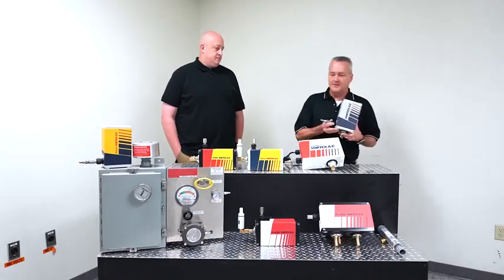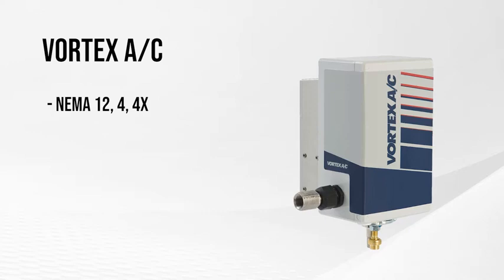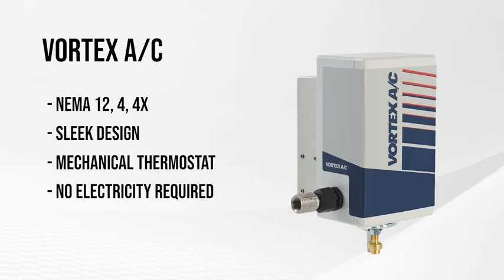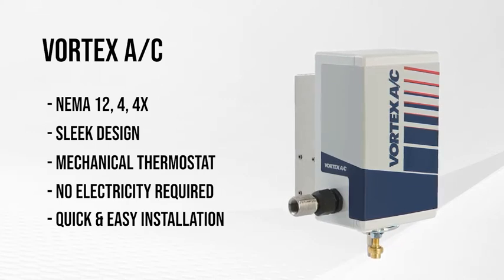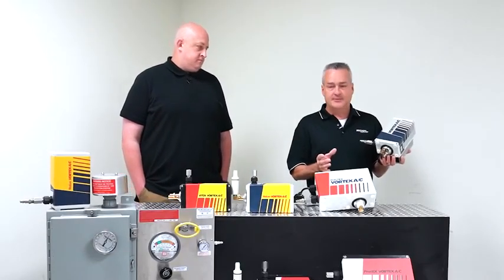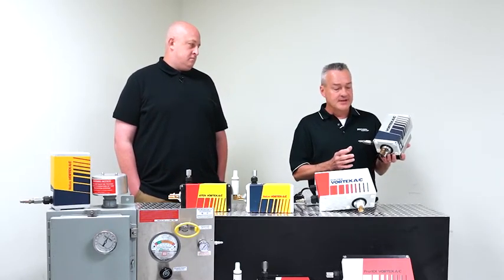We'll start with the VORTEX AC. The VORTEX AC, we have them in NEMA 12, NEMA 4, and 4X. It's a sleek design. These units all have mechanical thermostats. The mechanical thermostat is just that. It doesn't require any electricity. So the main benefit is the ease of installation. We can typically install any of these coolers within, say, 5 or 10 minutes. It's just a matter of basically drilling a hole in the cabinet. It's a standard 1.5 inch electrical knockout, which is a trade size.